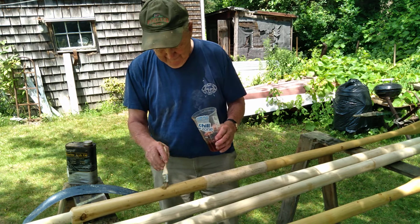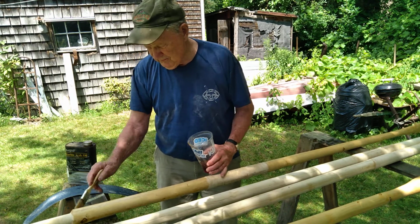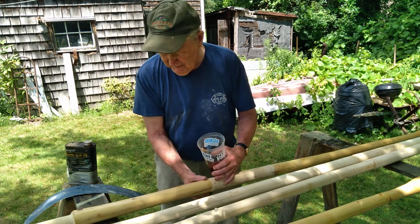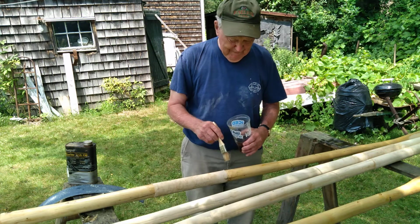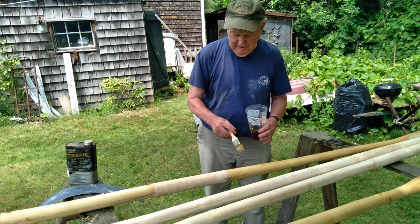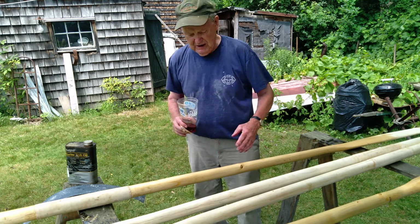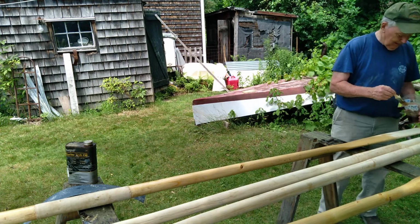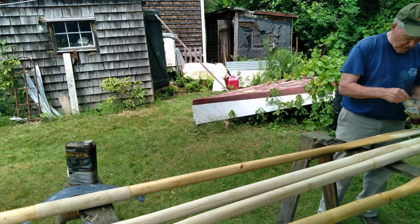We had a bunch of high school kids, and we'd get draw knives and spokeshaves at a real shop. Oh, we'd use hand planes too. In some places the hand plane is real good, especially if you've got some knots or rough places where the grain isn't smooth. You just use a sharp hand plane and get it right down to the thickness or roundness you want.